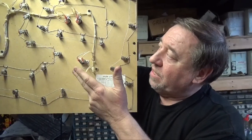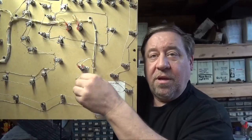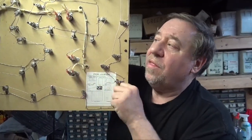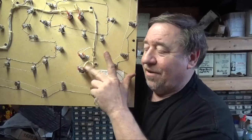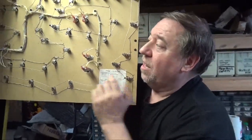And notice Gottlieb has slide-on terminals. These originally were all slide-on, right, Tony? On this game, I think. Yeah. On some of the other games, the other ones are soldered directly on, but it makes it very, very convenient. So you can switch them. So if you have an LED that's not flashing, try just switching it, and then it'll probably start working again.